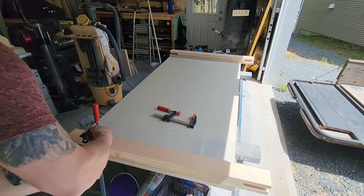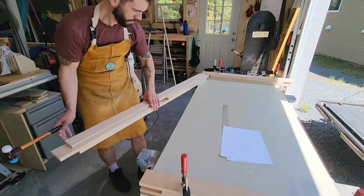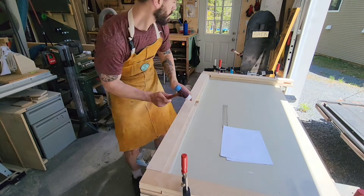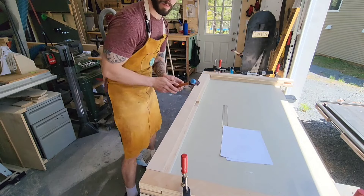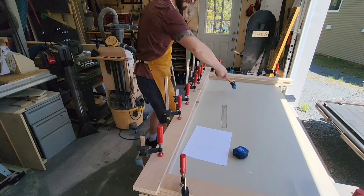I really don't think you can do any better than a real world template. What you can see here is me applying the leg system on the actual top that I'm going to be using. Yes, the legs will go underneath, but this allows for the exact measurements left to right to make sure that there's no errors. All the guesswork is taken out of it.